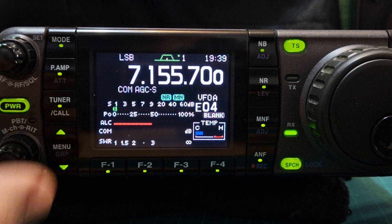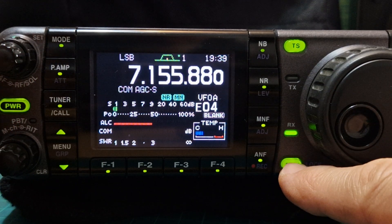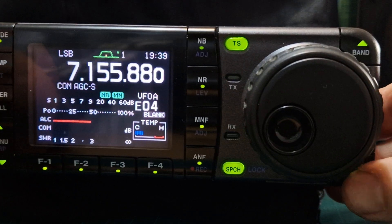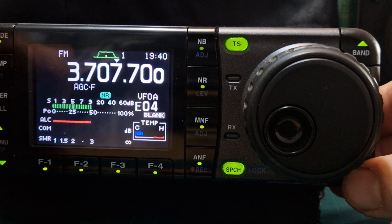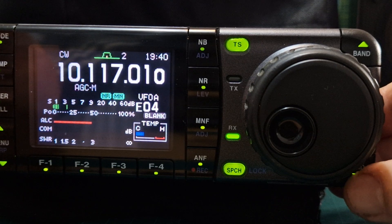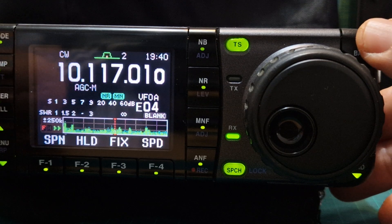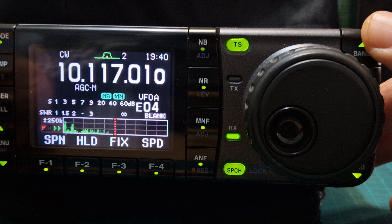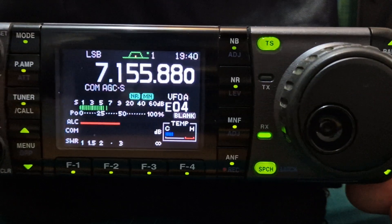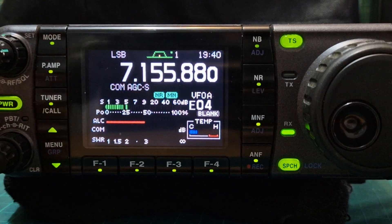I've tried to replicate the response of a Triple Four, and I have been told it's too loud in the past. Nice VFO. Speech announcement — I'll turn it off. And if you go here, up and down with the bands — that's 80 metres. You can see the different bands, and we'll look at 70 centimetres in a minute. If you hold the band button, it just turns on the scope — that's pretty good, like a shortcut. On air, a station reports: solid 5.8, trying to creep up to 9 but didn't quite make it — running just an ordinary mobile whip.